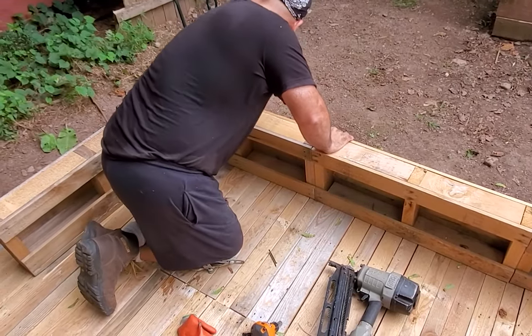The door is not a traditional door with hinges — it's just a panel you can remove that lines up with the base. Grab some 2x4s for support, add slats on one side so animals can't get in. The key is I use flat plates on either end as stops. The panel fits in a little tight, which is what you want — the flat plates lock it in place and it's not going anywhere. Animals will try to push forward but they won't pull it out toward the door, so this is more than enough. And it lines up perfectly with the rest of the base.